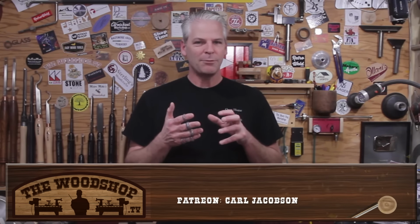As far as turning this stuff, it is very fragile, chips a lot. You probably noticed in the video that a layer peeled off. I have 6 rings here. I made 10 of them, so everybody loves math. That's 4 of them that blew apart on me, but when you get them done, it's well worth the effort. I put several coats of the enamel over the top of it. If you do have some chips, you can use 5-minute epoxy to get them back together. Really cool stuff. I've been working with it for years.